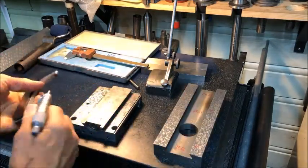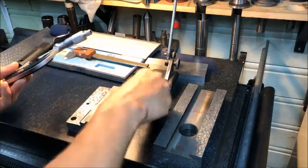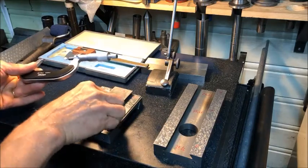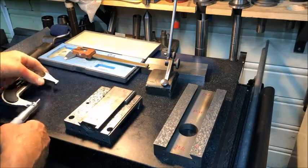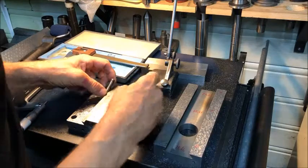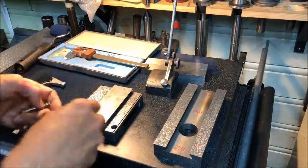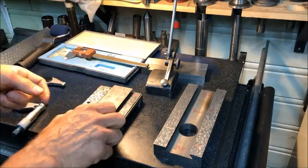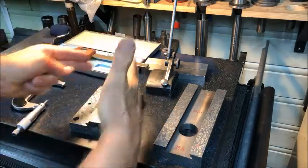Then the saddle, measured with pins at three positions again, and with a micrometer. This is the front, and here we have zero, plus one, plus two — which means it's a little bit slimmer here than here, and it's tapering a little bit like that.